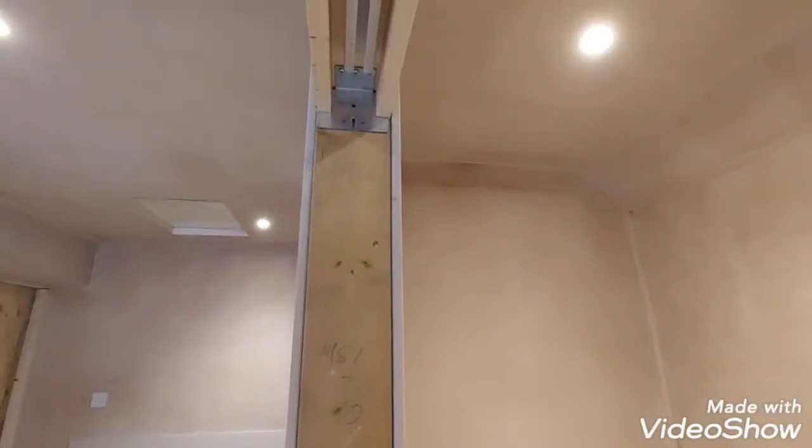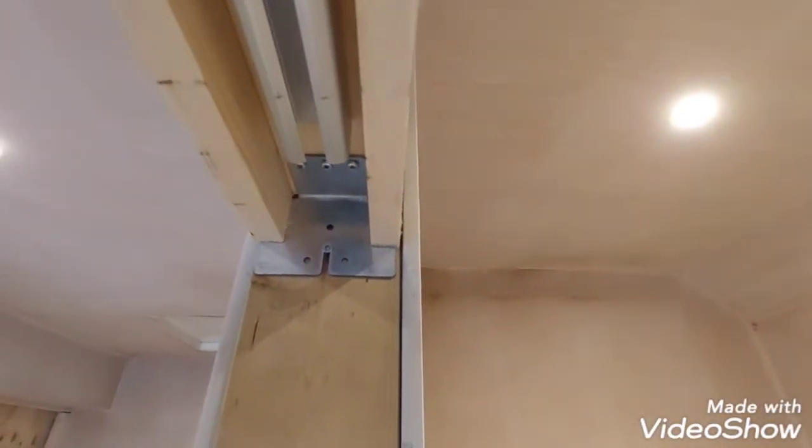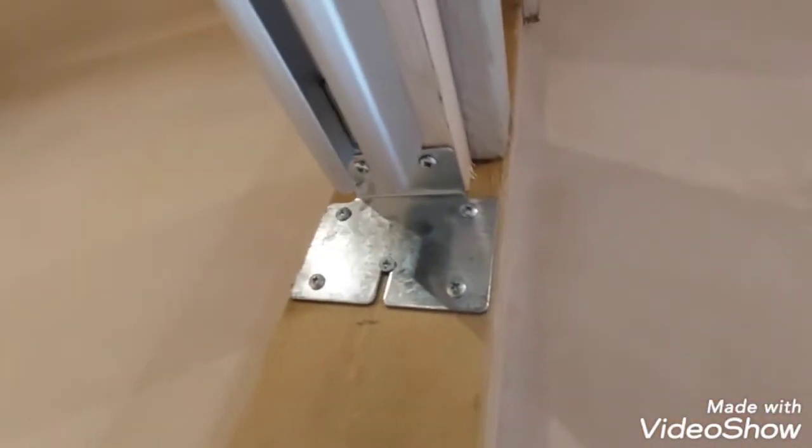I don't think that's going to work because you need to have much more headroom for that and I don't have it here. I'm going to improvise a little bit — I'm going to remove the guide screws and just slide this into position, because there is not enough room above it to twist and turn. I removed the guide screws, fitted the rail up, pushed the rail up, and then refitted the guide screws back into the same position. Now I'm going to fit the other screws — those 25 mm dome head screws.